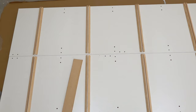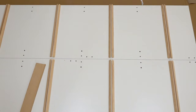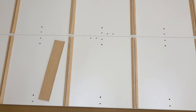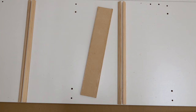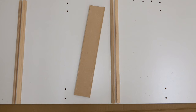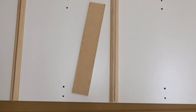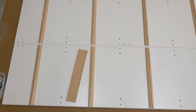All the support rails are adhered down. I did have a problem — I expected the white top and bottom timber to be solid but it's hollow. I wasn't impressed, but I adhered them down with glue and they should be fine. I adhered the left side down first on all rails, let that cure, then used a piece of 5mm MDF as a spacer — the same width as the upper support — to ensure I had the right amount of room before adhering the other support rail down. I'll wait 24 hours to make sure they're really well glued.